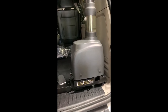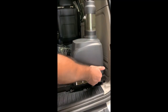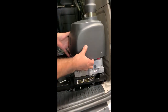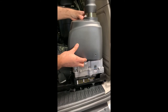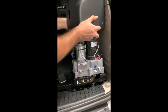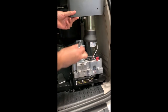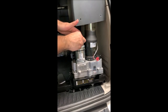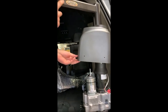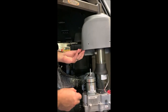If we're having issues with the lift and cannot bring it in, there are going to be two knobs on the front side and two knobs on the back side. Go ahead and remove those knobs, and from there you'll be able to lift the panel up. We're going to have a backup crank — take this off and put it right onto the motor here. As you spin it, it will bring the arm either in or out. That way, if the lift is stuck, you're able to bring it in and at least be able to drive the vehicle.